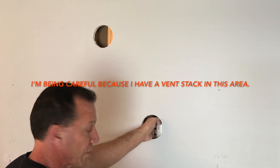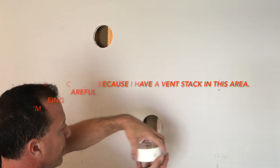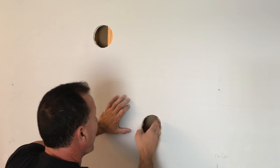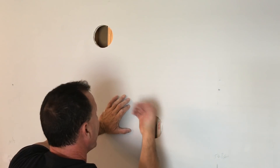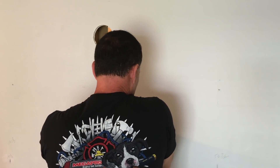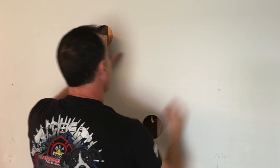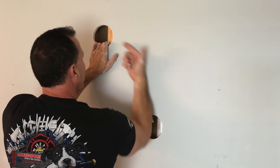There you go — it's right here. So I'll just take this, turn it, and it pulls right off and my piece is just going to fall right out. Now I have my PVC pipe right here — the vent stack — and I know I have a wire up there so I'm going to have to get my arm up here and feel for it. And it is coming from up top, so I'm good. It's going to come from the top plate down, so when I drill this hole I'll be able to pull this up and feed it through.